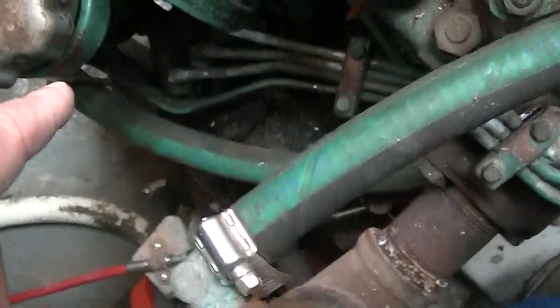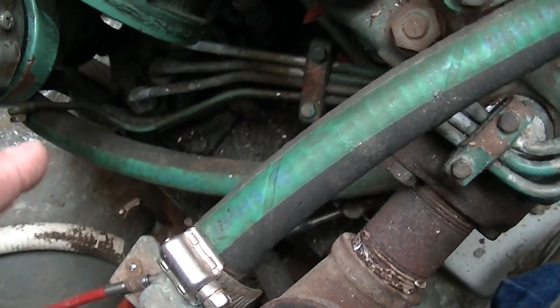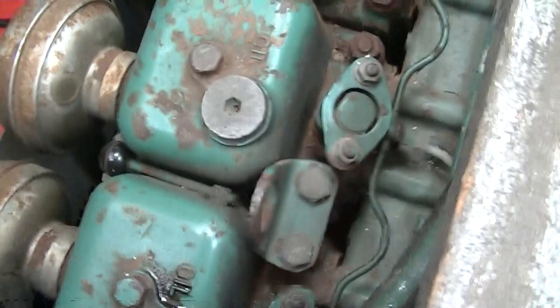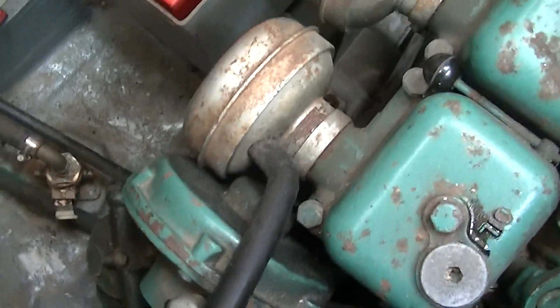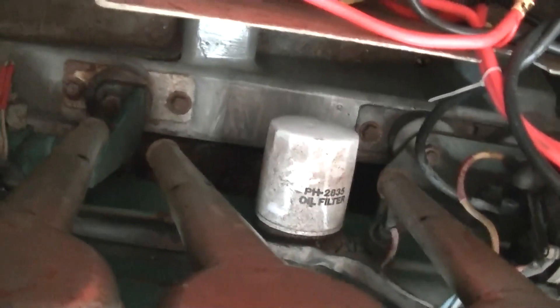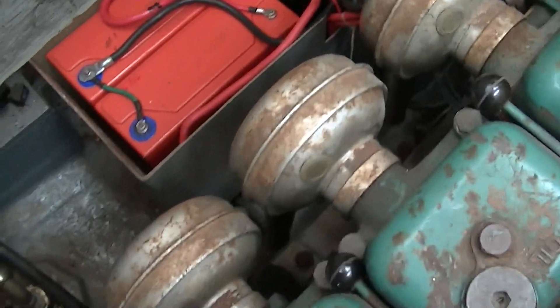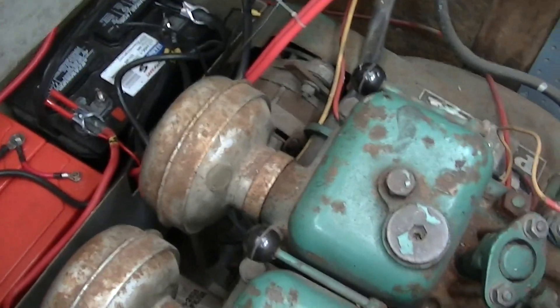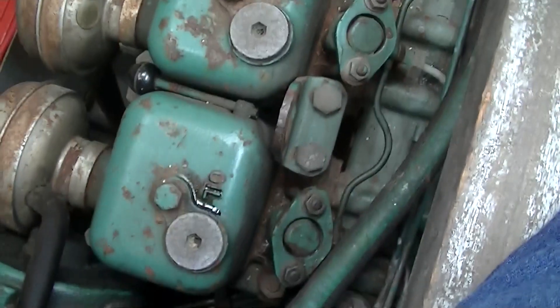Here's the injection pump down here. I brought rags and solvent so I'll clean off the old oil and get it cleaned up before I service it. The engine has about 980 hours on it — not bad, one quarter to a third of the way through its service life. Here's the oil filter. The intake silencers I'm going to take apart and clean; there are air filters in there that tend to get neglected on a diesel and cause smoke.